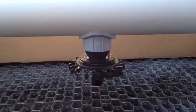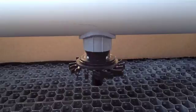And for a four foot water pattern, elevate it four inches above the fill media. The variable flow nozzle can be positioned from one and a half all the way up to 24 inches above the fill media.